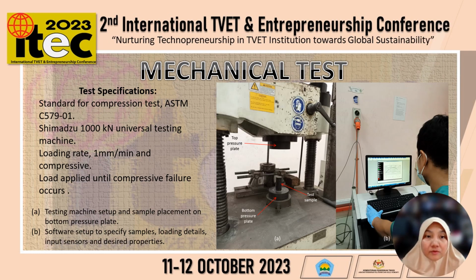Mechanical tests involve compression tests according to ASTM C579-01. A Shimadzu 1000 kN universal testing machine was employed. Loading rate was 1 mm per minute and compressive load was applied until compressive failure occurs.